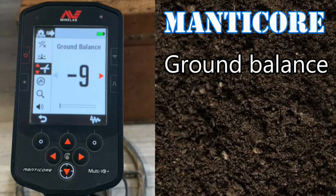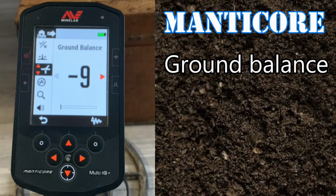Ground balance. This is a bit of a bar steward. Ground balance is a tricky one, and it seems to be even trickier with the Manticore. It is crucial that you get your ground balance set correctly to get the maximum performance out of the machine. You're only talking slight percentages, say, but that can make all the difference on the right ground. One of my friends has spoken to one of the engineers who said this is the right process, this is how to do it.